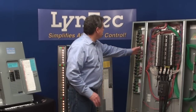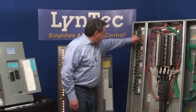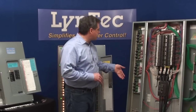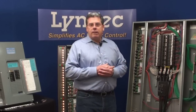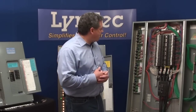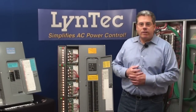After you land the wires, we have a set of jumpers where you set a series of three to five jumpers to determine where your delays are and what your step rates are as you move through your sequence. Those can be customized by board if you'd like. Thank you for your time — please don't hesitate to call if you need our assistance or would like to know more about the MSP series panel boards or the MSLC series modular sequencing load centers. Thank you very much.